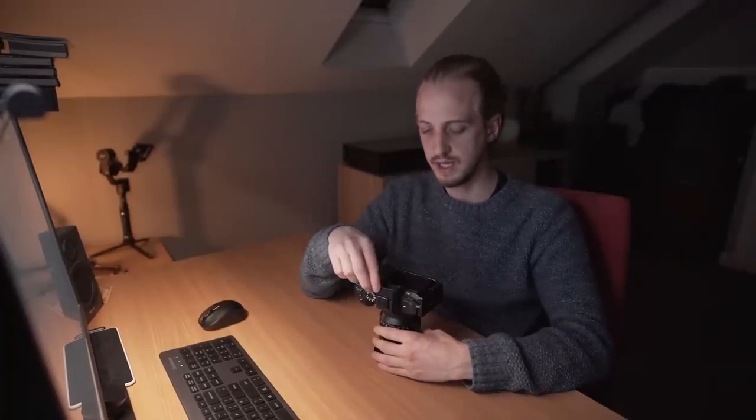Now, the autofocus — my autofocus still works as normal. I think that's because Sony's autofocus works by contrast detection, but don't quote me on that. Sometimes when you have a camera modified, the autofocus stops working, so it's worth checking with whoever's modifying your camera. If you're removing a filter, you may have to replace it with a simple glass filter to make sure the autofocus still works after the mod. But the modification that JTW Astronomy did on my A7S II — the autofocus still works flawlessly.